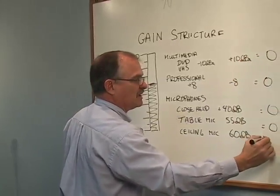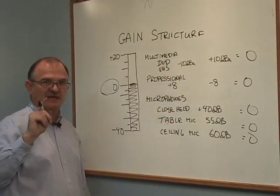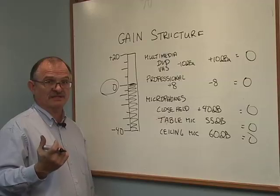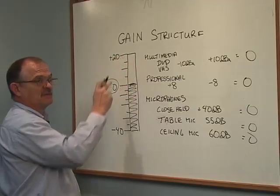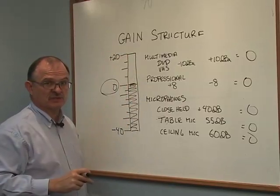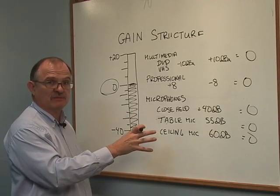Everything you want to get is on the meter at 0 dBu. If you get all the products participating at 0 dBu, and that includes the DMTH4, our conferencing hybrid, you want that incoming telephone line signal to try to come in at 0 on the meter. It's not going to clip until it gets up to plus 20. So even if you maximize your level on the control, you're not going to get clipping until it hits beyond plus 20. And with 20 decibels of headroom, that isn't going to happen. If you're worried about that, you can apply a compressor to the input, and that's another segment.